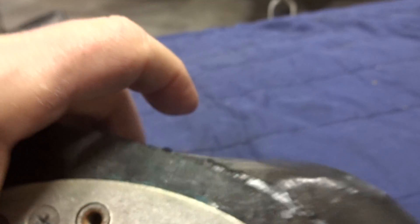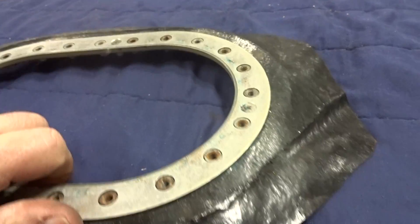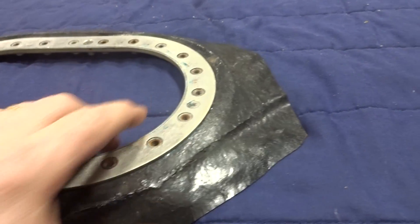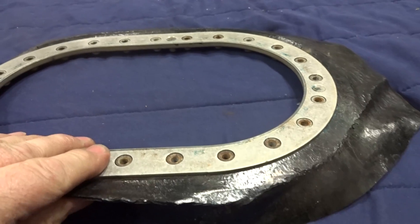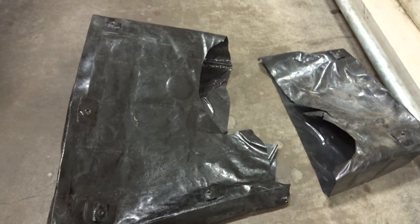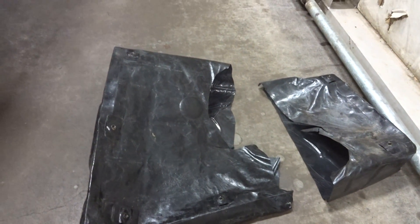Here's another piece of it — we had to cut this to get it out. Here's the top plate, and you can see how badly it was cracking. This cell was starting to leak when the fuel tank was full, because the tops of the fuel tanks, if they're not immersed in fuel, they'll get dried out and start to crack. Both aux tanks on the airplane were leaking. When we got the tanks defueled and started to pull the tank out, that's when we discovered it had the consistency of hard plastic and we actually had to cut it in pieces to get it out, which is usually not the norm. This one lived way beyond its life and was just starting to leak from the top.